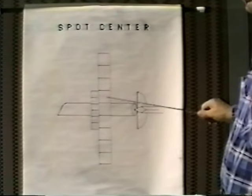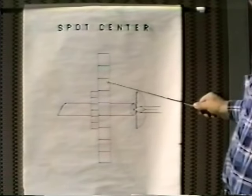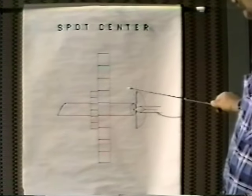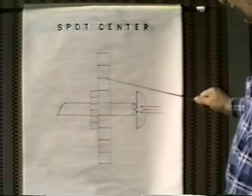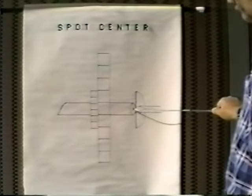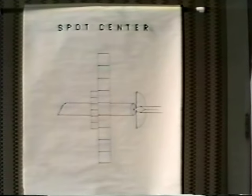The trick to this is to turn your lathe in reverse. If you have a switch on it, switch it to the reverse. If you don't have a switch, take your belt off your pulley, twist it, and put it back on — that'll make your lathe go into reverse. With your carbide graver, flat side facing up, your lathe goes in a reverse motion and it'll cut that little dimple we're looking for. I just want a small dimple so that we can have a guide for the drill.